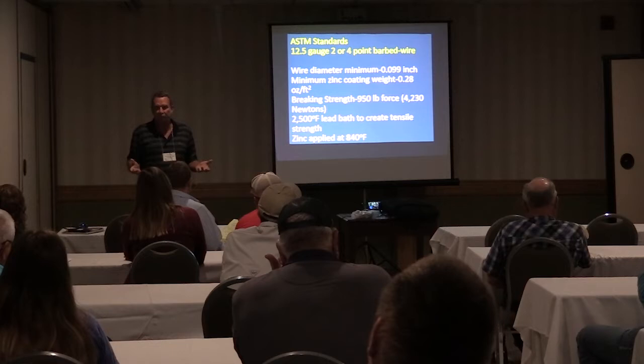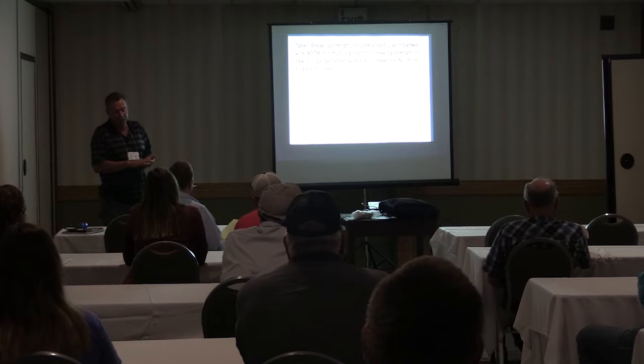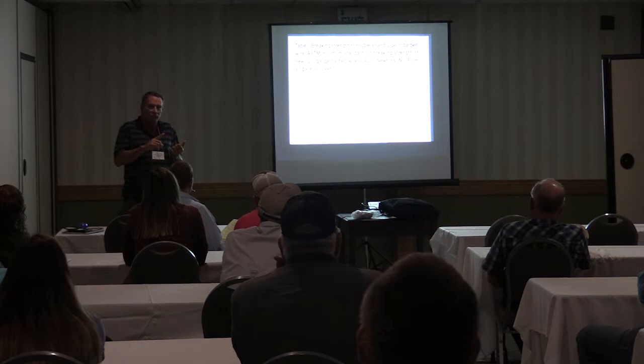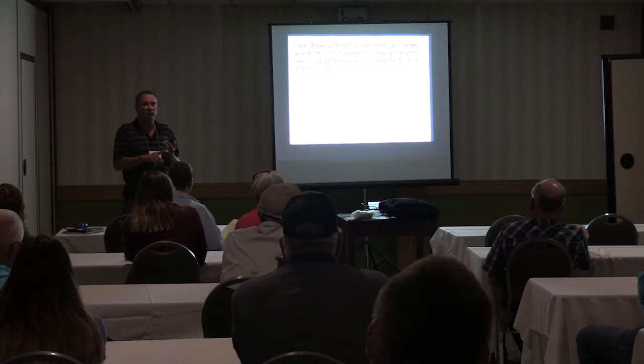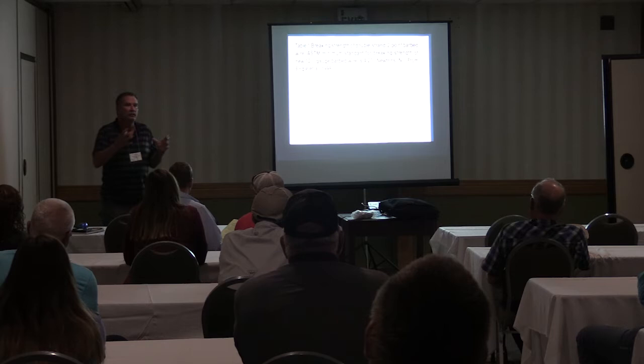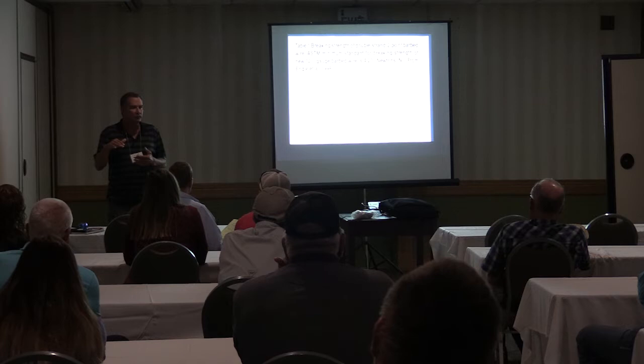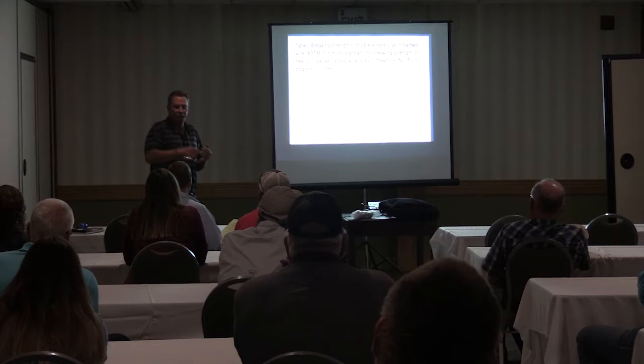What we did was look at different wire samples. At that time, we had our study going on. We had wire that was unburned; we had original wire still in the roll that had never been put out from a large fencing project at the research station. We sampled areas that had been burned through one time, burned through two times, and burned through six times. These are prescribed fires in tall grass prairie, so we got fuel. All the fires were started on the outside of the fence and let run through the fence numerous times.